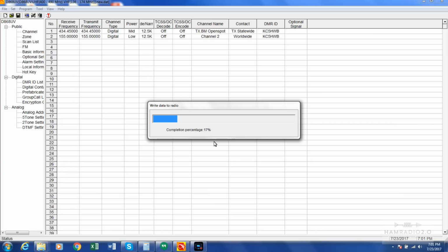You can go through and you can set your color code, transmit and receive frequency, set narrowband or wideband. It'll let you pick which DMR ID you want to use. I had some talk groups in there because I thought DMR ID was different, but I think it's a multiple user-based radio. Haven't seen that before. That's really cool. So it'll let you pick the DMR ID, and then it has you pick what they call the digital contact, which has group contacts, which are your talk groups, and private contacts, which is what you and I have. So you can set up a channel to do a private contact between one person and another. But it doesn't have anywhere to set your time slot in the menu on the screen of the radio. So I think that's probably something that's just missing, and they'll have to add later.